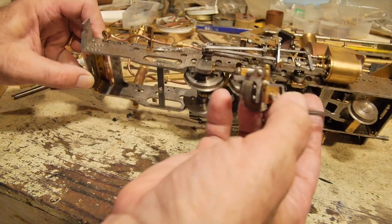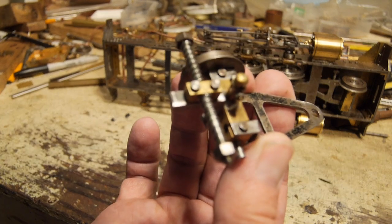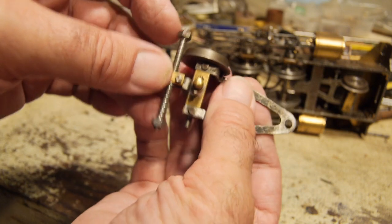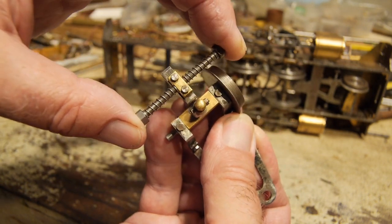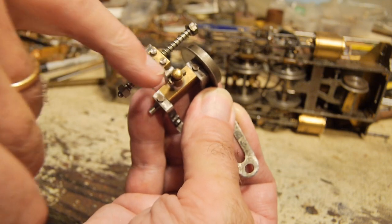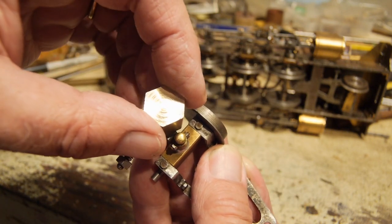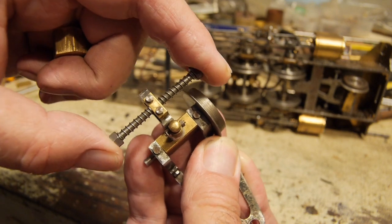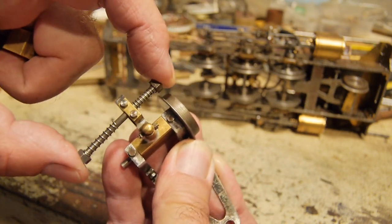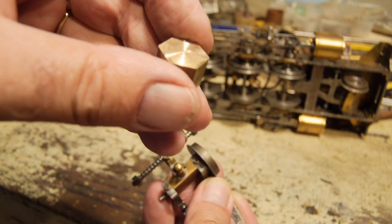I have it quite successfully at the front, but the problem here is that the bracket I put the slider on — which has two springs for the side control — is a little bit too narrow. What happens is it jams in the hole, and of course there's side thrust as well. So what I have to do is take this little brass piece off and make a longer brass piece to give it a better hole that isn't going to jam. Even with lubrication it feels sticky — you can see it jams when I try to move it with my fingers, and it'll do that to the engine going along the tracks. So I'm going to remachine this and make it fit properly.